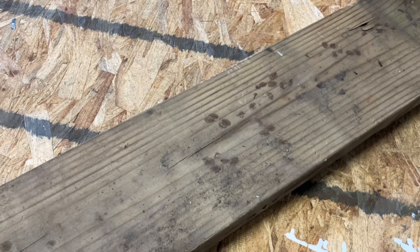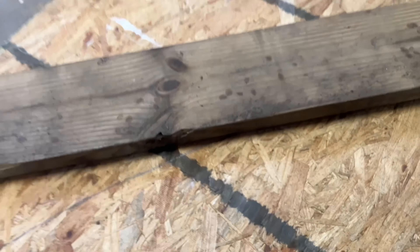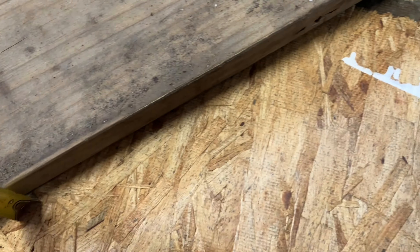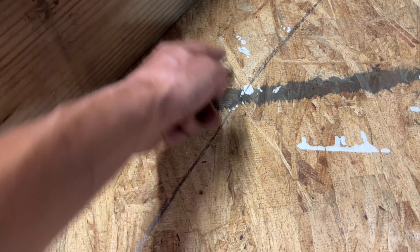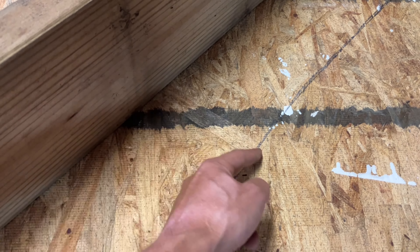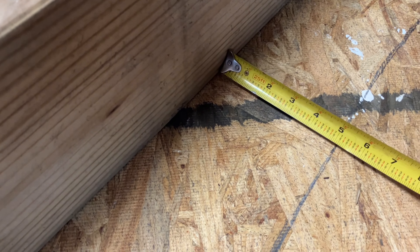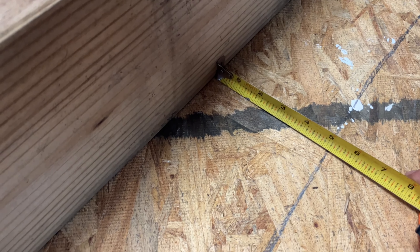The reason I'm doing this is because I'm going to have to carve like a half moon into this board, and every bit you carve into it makes this portion thinner and thinner. In the carpentry world they call these two by eights, but the real measurement is actually about seven and an eighth wide by about an inch and a half. You don't want to take out too much meat. If I kept this board right here, at the narrowest part I'd be at about five inches.